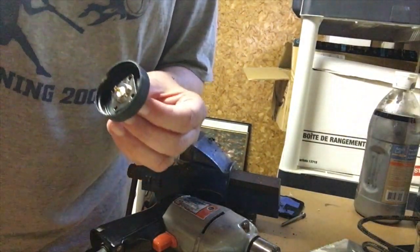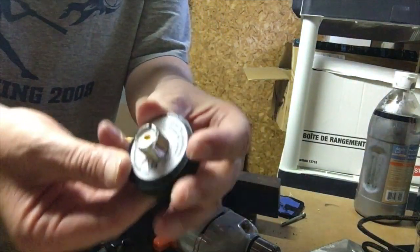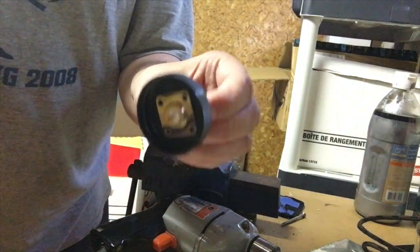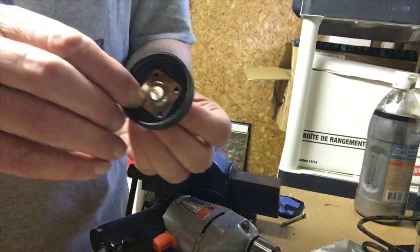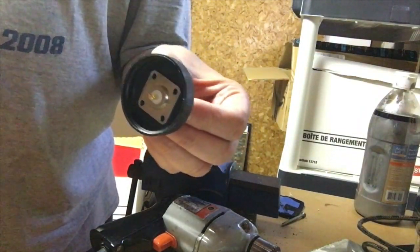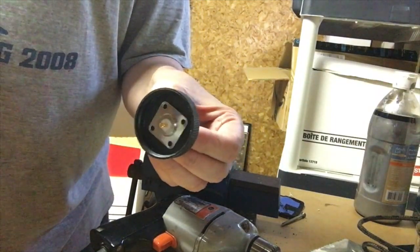The next thing to do, now that this fits and that's going to be nice and clean, I'm going to drill little holes in here for the screws to hold the SO239 to the lid. One of these screws is going to be a bit longer than the others, and that's where I'm going to tap my ground connection from the balun right to there. So that's the next thing to do.